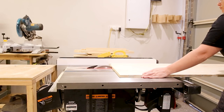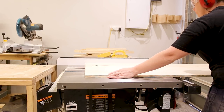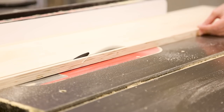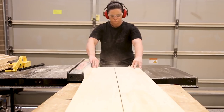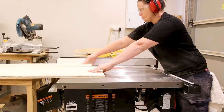This project was created from one project board which was 1200mm by 600mm plywood that was 18mm thick. I started by cutting the plywood into three equal strips of 200mm wide. This project is sized to fit my pots that I purchased, so if you'd like to make this project I would suggest buying your pots first and then sizing from there.